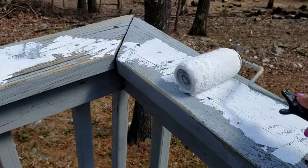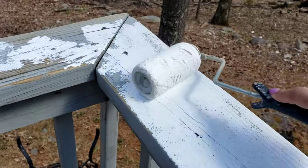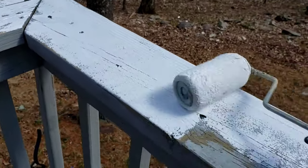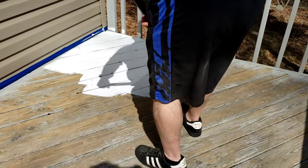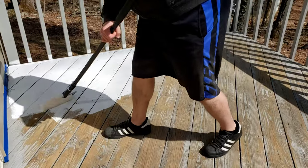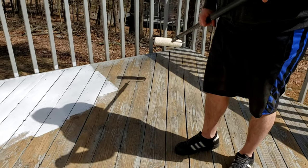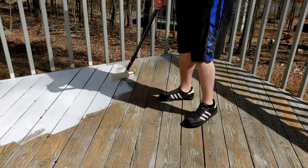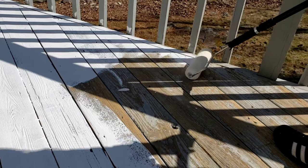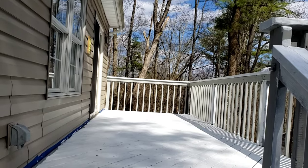We started painting with the banisters using the primer. You really want to push it down — it's not like wall paint where it's applied loosely and thick. You want to take really thin coats of the primer and push it into the grain of the wood. You can see my husband doing that here — it's really nice and thin but inside every single crevice. A quick tip: take slow and short brush strokes to ensure all the primer gets into all of the grooves instead of one long continuous stroke.